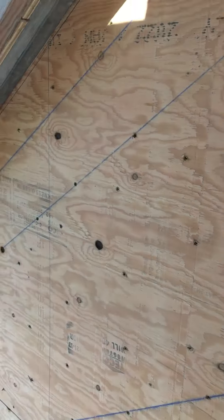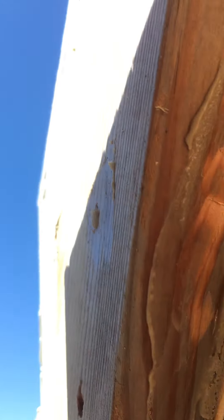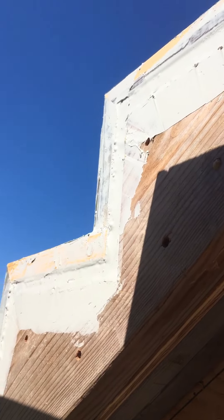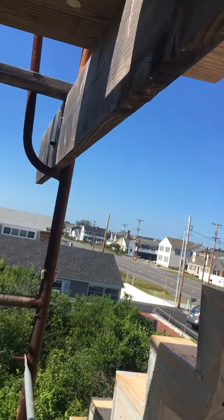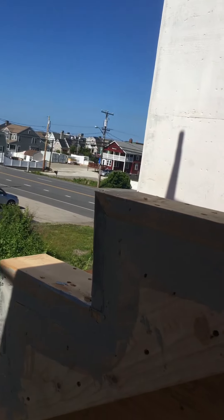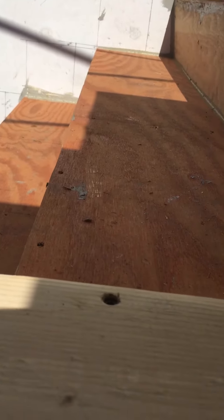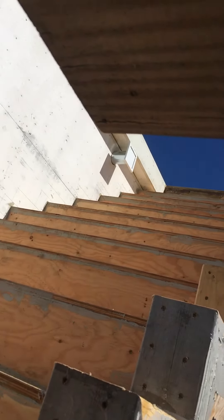Anyway, that was a built-out curb — three two-by-tens with a piece of half-inch to make your five inches, coming out to the edge of the plywood on your stair rise and tread. We'd left it wild, but that's going to be all painted and cleaned and ready when we come inside. Just showing you how we ended up doing it and some of the details we do.